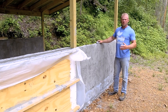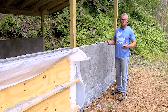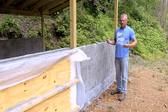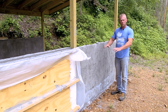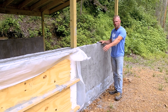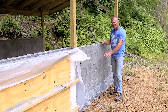Now when you get to pouring, there are a couple of considerations. Aircrete is very porous — concrete in general is porous, and we all know that concrete wicks up water. We didn't want to wick up any extra water from the ground, and we wanted a good solid base for it to sit on. There's no footer here — this aircrete is sitting right on top of the red gravel. The posts are in concrete, but the aircrete is just sitting right on top of the gravel.